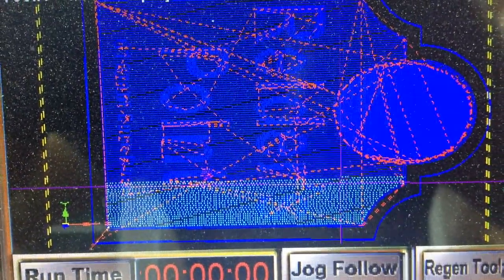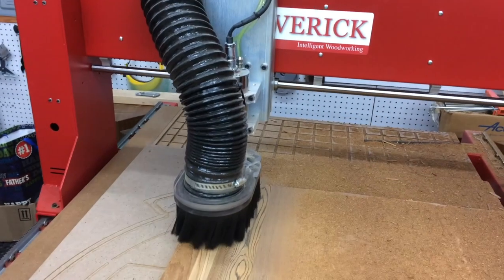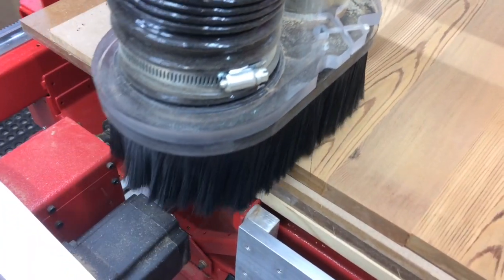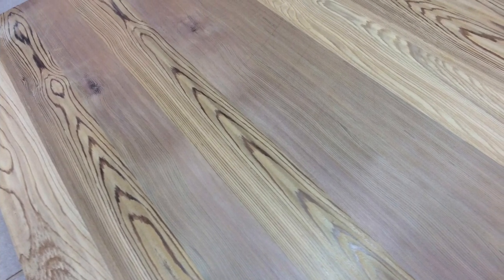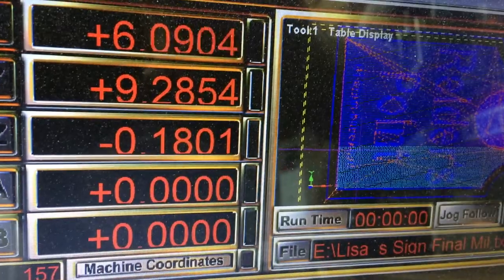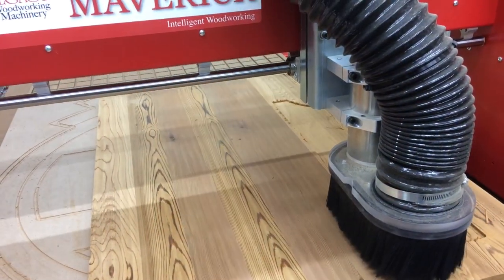Here's the control panel as the cutter head moves front to back. There was a lot of sawdust — the cedar fibers clogged my dust collector, so I just let it run and cleaned up later. Here are the completed boards: all glued up and surface-planed on the CNC, perfectly flat. All the irregularities were totally gone — this is a great plank to work from. Now let's go ahead and start cutting out the recessed interior area of the sign.